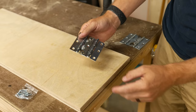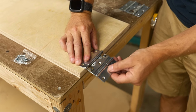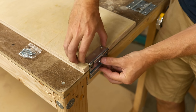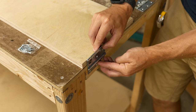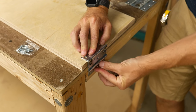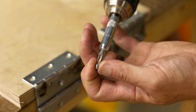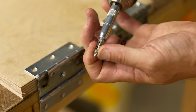I've got this panel in place and the big thing that makes this work is this hinge. It's going to attach on the top here and fold down and then attach here to the table. This gives it two different ranges of motion — the top panel can fold over this way and then the entire thing can fold down that way and roll flat. I'm going to put these in place, pre-drill the holes, and screw them in. To put these hinges on, I'm using a self-centering bit — it has a little spring-loaded collar so it will center itself when you drill the hole.